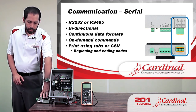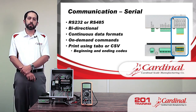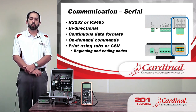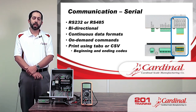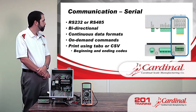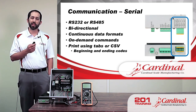As far as serial communication, the serial port is on the lower right of the 201. It can be RS-232 or RS-485, and both are bi-directional if set up that way. RS-485 is used if we need the serial connection addressed — kind of like an IP address over an ethernet connection — so we can communicate with multiple devices over a single serial port. RS-232 is point-to-point between one device and another. With bi-directional communication, we can send the 201 commands to do things like zero the scale or set tare weights. There are also a few different continuous data formats to continuously send weight out to a computer, PLC, or other device.